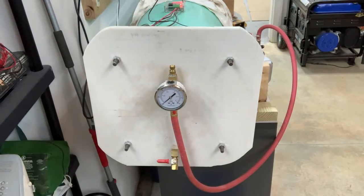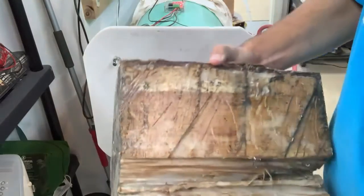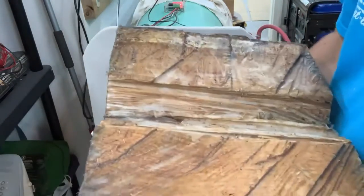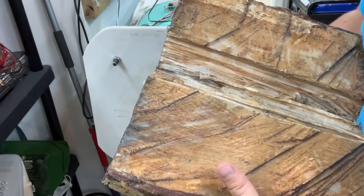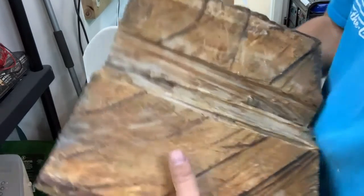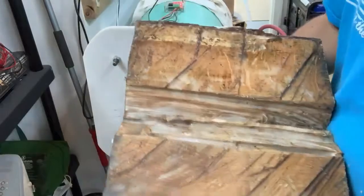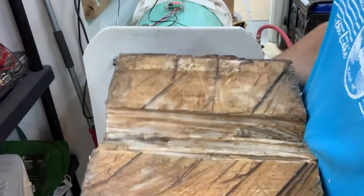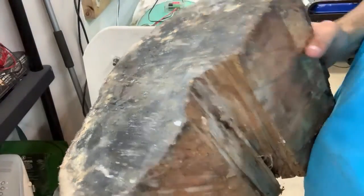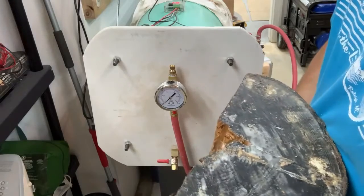I've got a piece of oak over here. So this is a piece of the same tree that I made my mantle out of — just a small piece. What's amazing to me — I had never really tried this before. I had some paraffin wax, or maybe it was candle making wax. First I cut the pith out of here because I knew that's what made it crack. And then I covered this with wax — I painted both sides. And it's been at least three years and there is not a crack in this thing. It's kind of amazing.